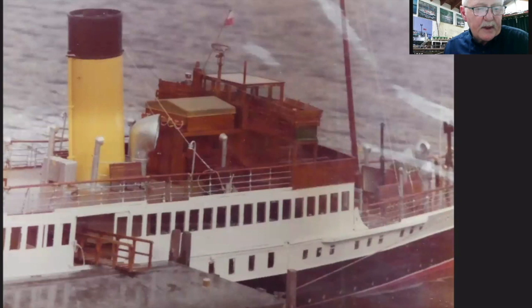The Duchess has a removable aft deck and a hatch to the lower deck to get to the dining room and prop shafts, which are over 4 feet long and have three internal bearings, which have to be lubricated. The engine and boiler room are accessed by removing the funnels, then the promenade deck. The fore deck is fixed. So I haven't been in there for 48 years. Should have left a message in there for someone.